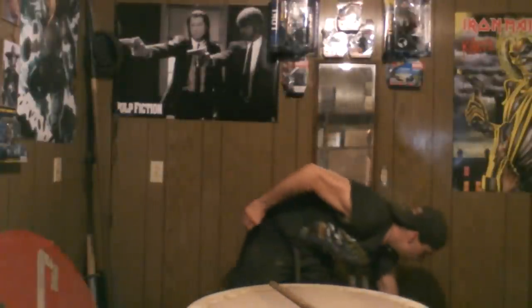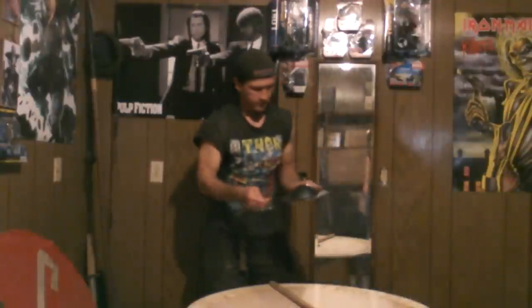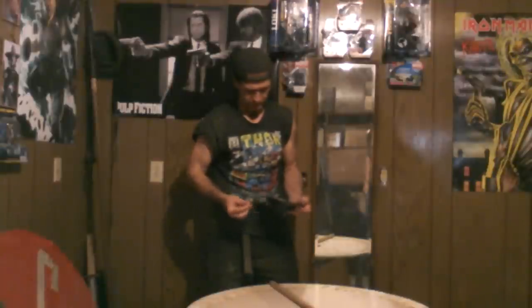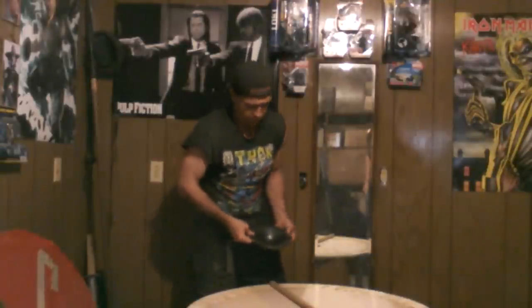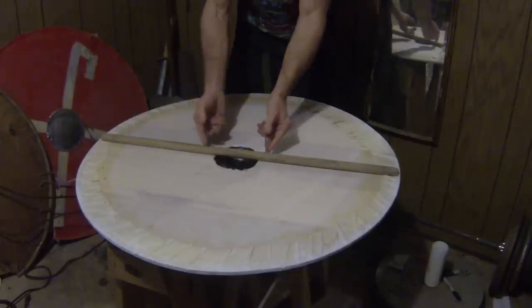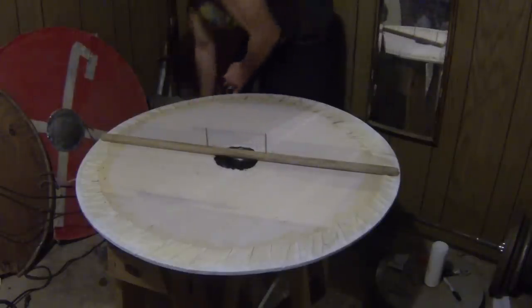We're going to go with our nails that we're using as rivets. And these are going to come up, try to use the same two holes you picked. Hopefully they're all the same all the way around. They should be. But this is where we're going to see how it works. All right. And we've got our nails coming up through. What we're going to do now is use the Dremel to cut them the length we want. You don't have to, but I've already put these underneath.